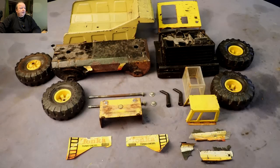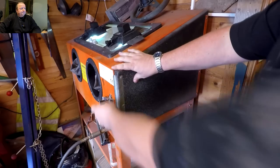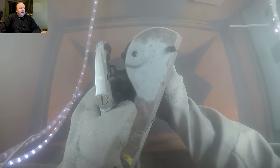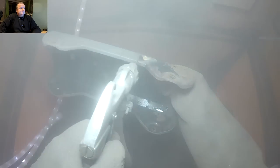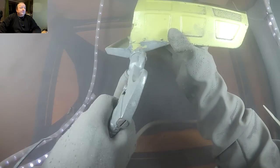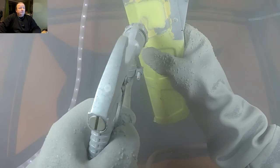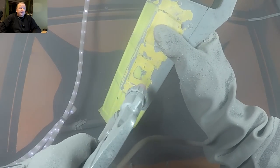So that's what we've got — plastic and metal parts. Luckily I have a media blaster and I use aluminium oxide in mine, so we'll get all this off. The great thing about a media blaster is that it takes it right back to new metal again. Something I do enjoy doing — I've since upgraded my cabinet and have very good extraction on there now. As you can see, someone has actually painted this before. I'll take the first layer off and there's the original yellow underneath. The media blaster found it really hard to remove that original layer, so that may have been powder coated.